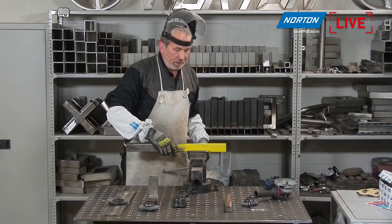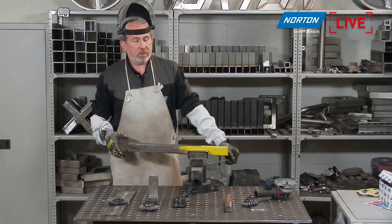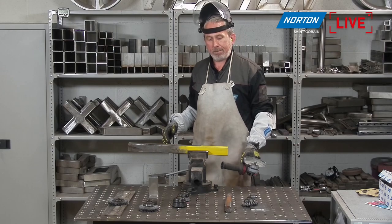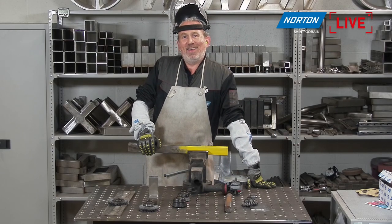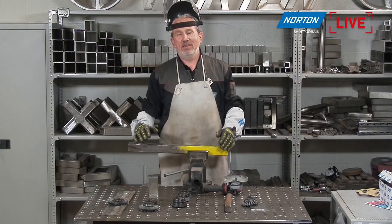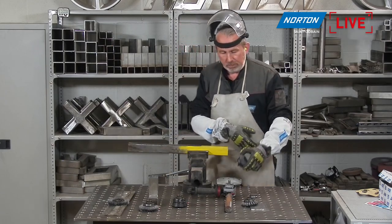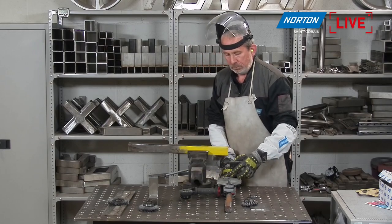But this is where the wire brush really does excel, compared to conventional. Yes, Paco. We have here just one layer of paint, but you can imagine a bar has been painted many times over the years. Maybe in the 96 years of the former queen, it has been painted 96 times. Then you have 96 layers. To remove this layer of paint, the wire brush is perfect.